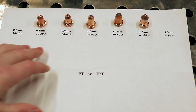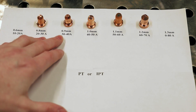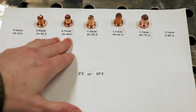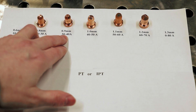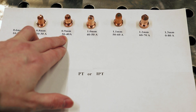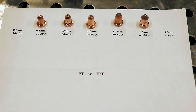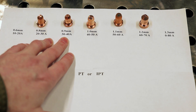So if you can cut at the lower amperage value, sometimes that can be beneficial. Now, on certain materials, if you don't have good quality nozzles at the lower amperages, you may not get as good cut quality — so do watch out for that. One thing I like to do is never run any of these nozzles at their maximum. I'd only run up to maybe 38 or 39 amps at the most; it just helps to preserve them a little bit more. But if you're getting them cheap enough and don't care, go ahead and run them at their maximum — it's just more of a chance of a blowout while you're cutting, and that could end up ruining a piece very easily.